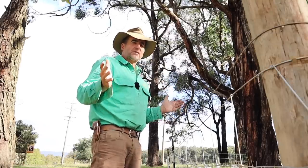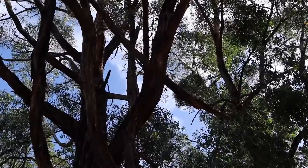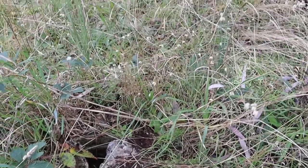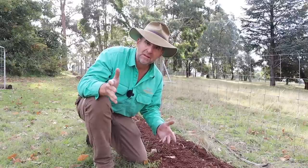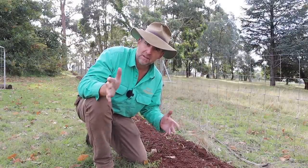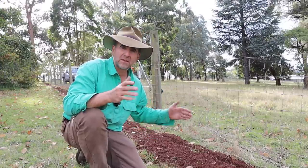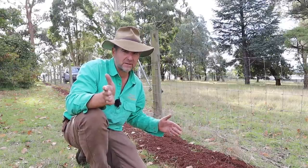If you're working under trees, are there branches or flyaways that could fall on you and pose a hazard? Make sure you've removed any of these or had suspect trees inspected before you start. And lastly, look down — are there buried services that you could potentially hit when you're driving in posts, causing injury or potentially costing thousands of dollars to repair? Make sure if you're fencing a boundary that you contact Dial Before You Dig. There's a link in the description. For internal services, always make sure they're at least half a metre off fence lines to give yourself wiggle room when you replace fences in the future.